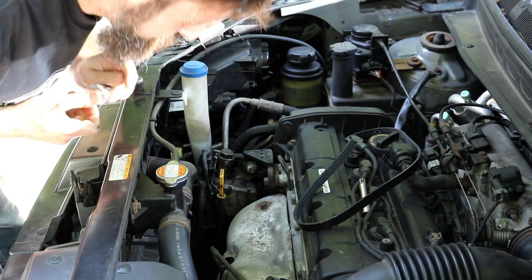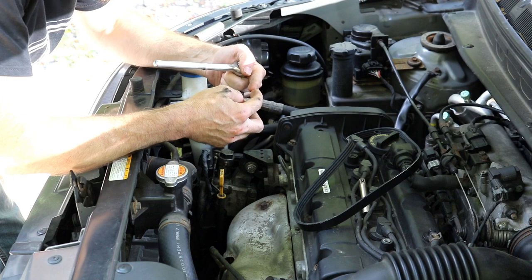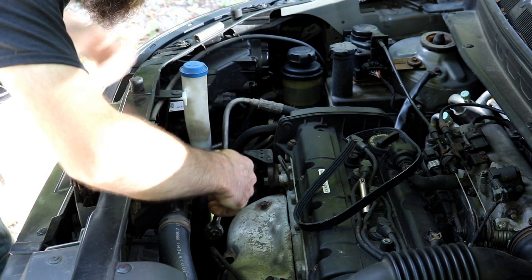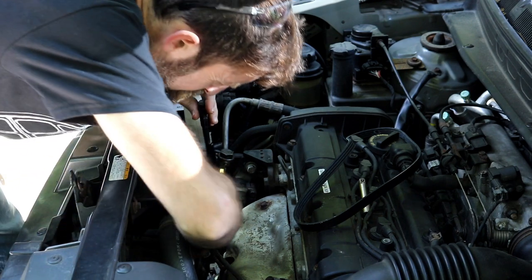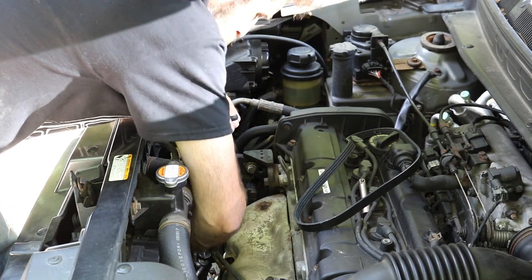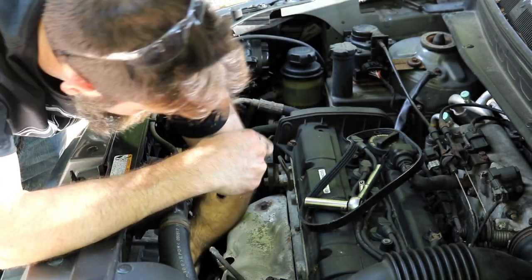Usually, on an alternator, you have three bolts. One main captive pivot bolt, one adjusting pinch bolt, and then one adjuster screw. That's almost every vehicle we have here, other than my old truck. So every bolt on this is 12 millimeter, which makes it kind of easy, I guess. Easier anyway.